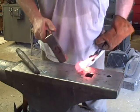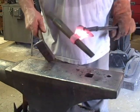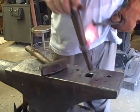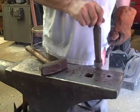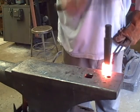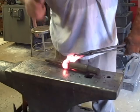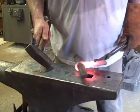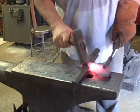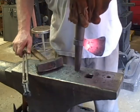Here I'm using a drift that's specifically designed for making a throwing axe — you can buy handles that will match it. The wide end is on the top of the axe; the handles go down through the top. Doing this would have been easier if I'd had a pipe that the drift would just go into — set the axe on top of the pipe and the drift through it for a lot more support driving it down. I didn't have a piece of one and a quarter inch pipe, but this worked too. You're seeing my whole method here — not very sophisticated, but it works.